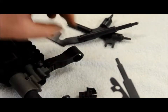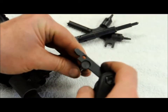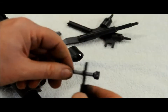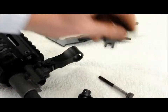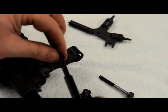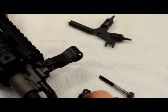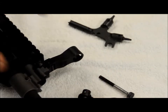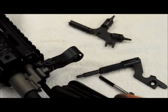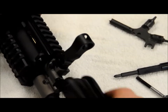Similarly in my tool kit, I have the semicircular cutout which fits around the head of the piston and around the base of the piston, and I have the scraping hole. The FN tool kit also has what looks like a three-diameter drill which fits down inside the bore of the cylinder and rotates to scrape out any carbon. In my tool kit, I have a three-stepped plate with sharp edges which similarly can rotate around to clean out the bore.